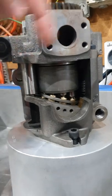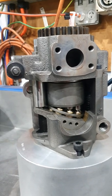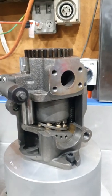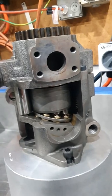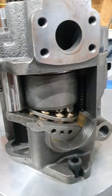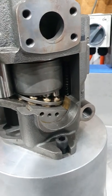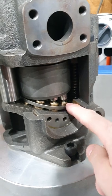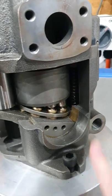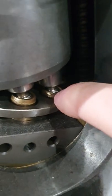When stuff gets dragged through that, you get grooves in there and it'll just lose performance over time. The catastrophic failures occur for two reasons — mainly high case pressure. If your line's blocked or it's plumbed incorrectly into a return filter or something like that, this plate here is trying to pull the piston down on the suction stroke, and the pressure in the case is trying to push it back up. That pulls the slipper off the pump, because they're only crimped-on brass slippers.